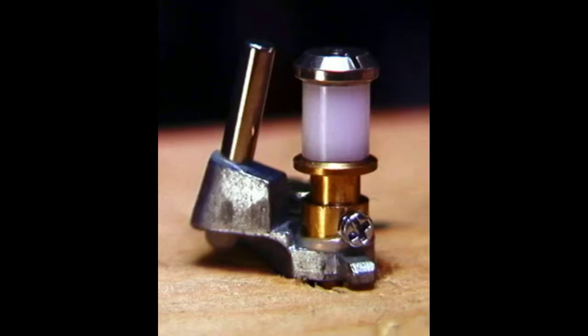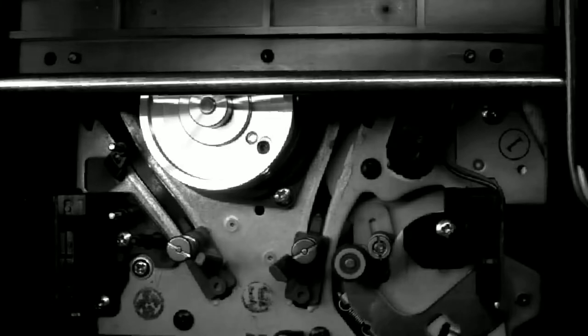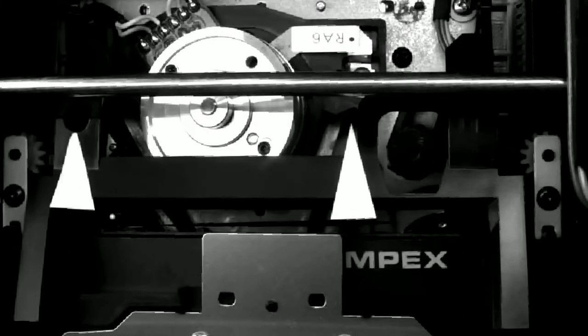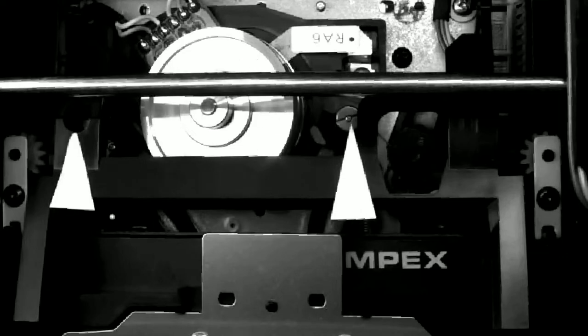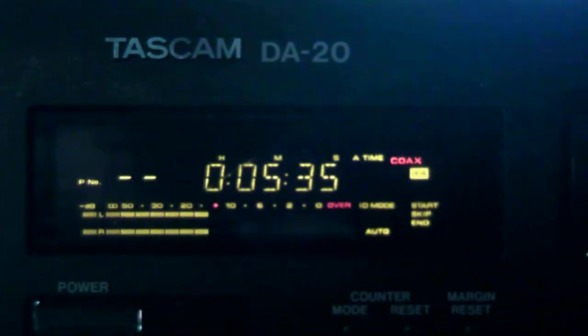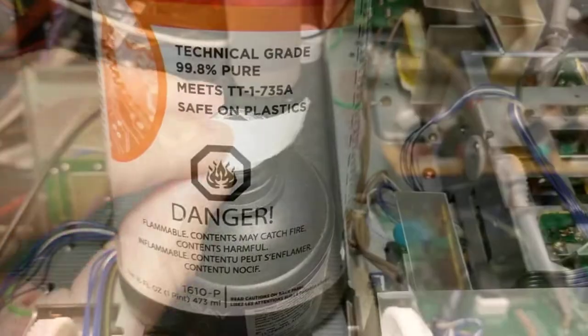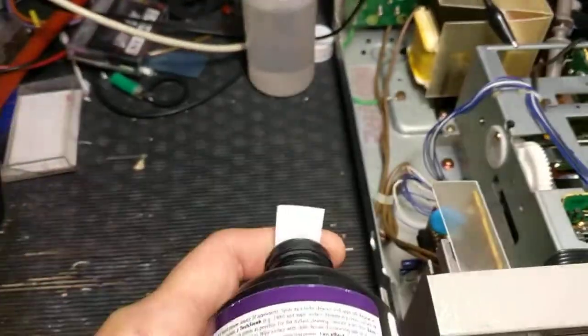This is one reason that some of the tapes you are trying to archive will be out of spec. When a DAT is inserted, the tape is pulled from the cassette, threaded around the head drum, and we hope the machine can pull the tape, read the timecode, and output anything but this dreaded sound. You already know the importance of manually cleaning the heads and fast winding the tape, sometimes multiple times.